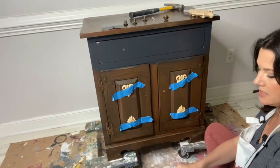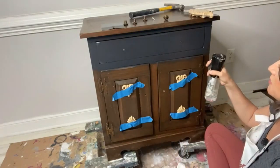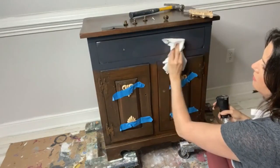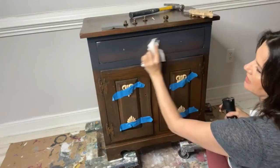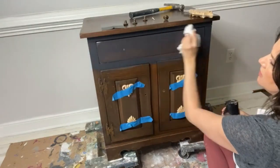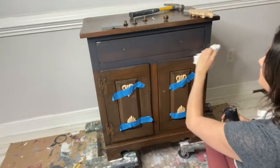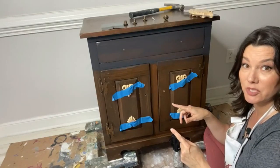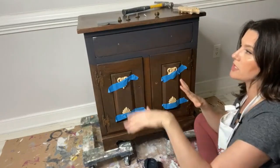Now it's on there. The next step is where you control how much you put on and how much you take off. I'm going to spray just a little bit of water and start to wipe back. You'll see the wood grain. I can wipe in one direction — I like to go with the wood grain. All we're doing is creating a wash of color over the wood. My brindle boxer Stella was actually the inspiration for this piece when I started doing this about four years ago.